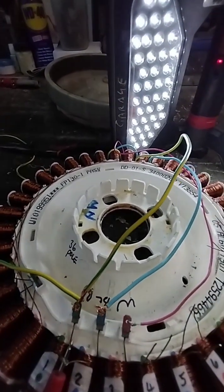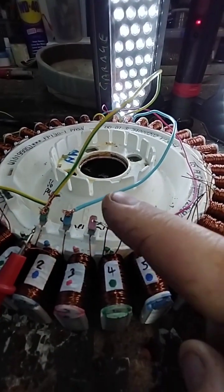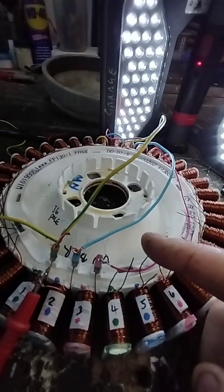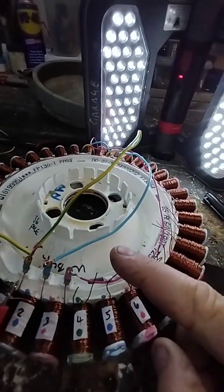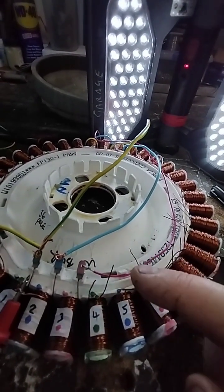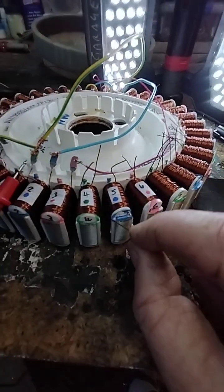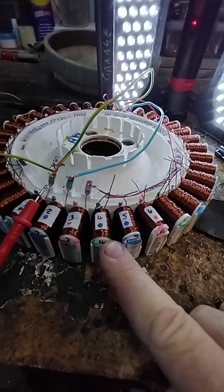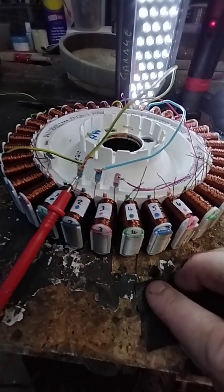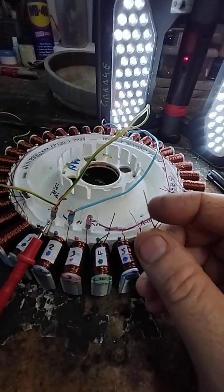Remember we've joined all the left hand sides of coils one, two, and three, and now we're going to do four, five, and six. These wires would now be moved closer to the edge and hot glue gunned into position. On number four, we have a left hand wire and a right hand wire. The right hand wire runs to its corresponding color, and the left hand wire gets peeled off its enamel coating. You'll find there's a gap between these two stators on the left hand side — it's the longest part — so you can bring it down to the bench.